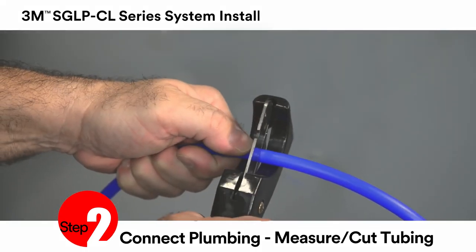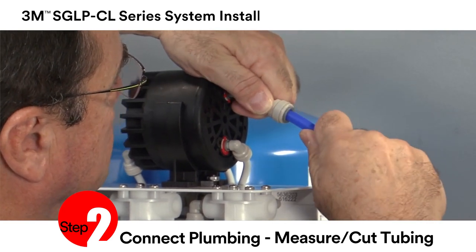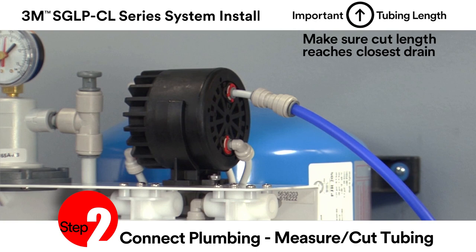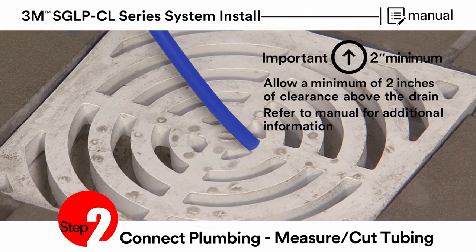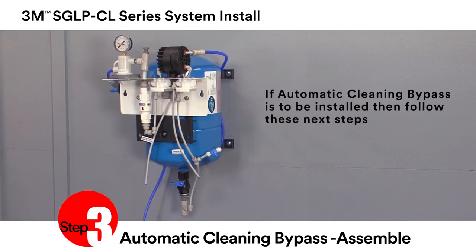Cut a length of 3/8-inch tubing and connect one end of the tube to the permeate pump on the top of the system. Make sure the tubing is long enough to extend from the drain fitting on the permeate pump of the SGLP-CL system to the closest drain. Make sure there is a minimum 2-inch air gap between the tube and the drain, or meet local standards. If an automatic cleaning bypass is not being installed, please skip to step 4.